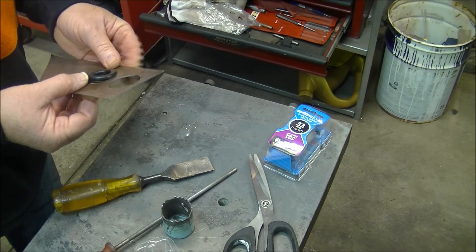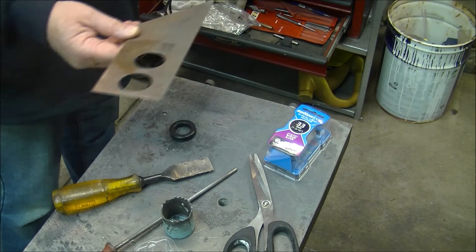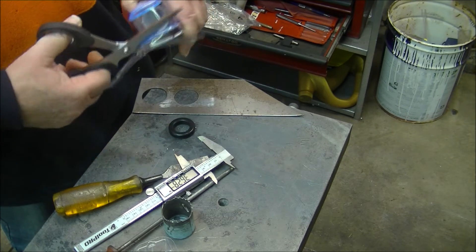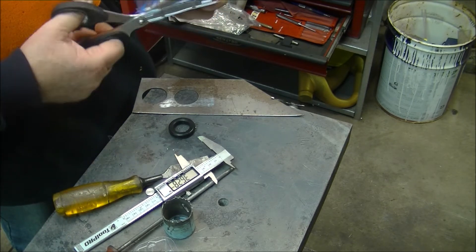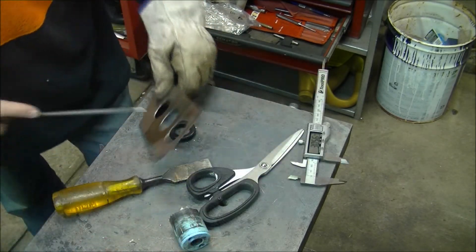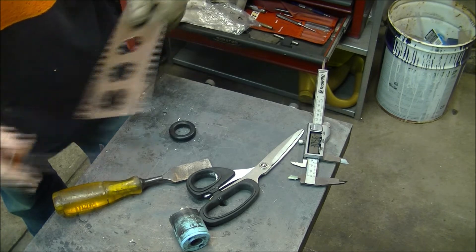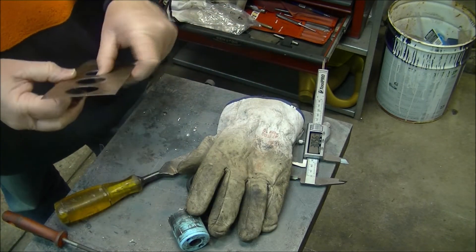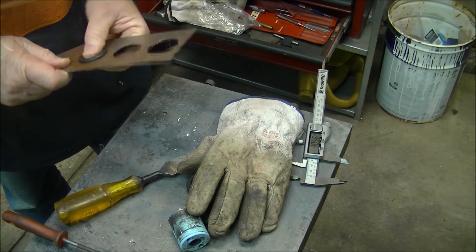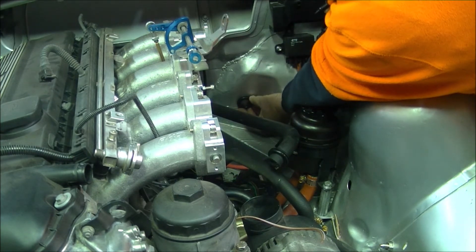The 35mm is no good at all — these are 35mm but they cut a 36mm hole. We'll try the 33mm hole saw instead. That's the 33mm hole and it looks like it's going to do the job. The holes need to go here and here, so I'll mark these out and have a look at the best location.